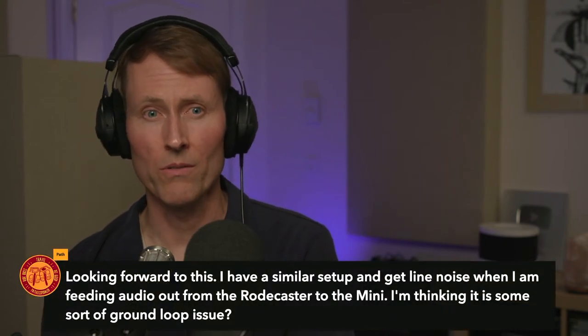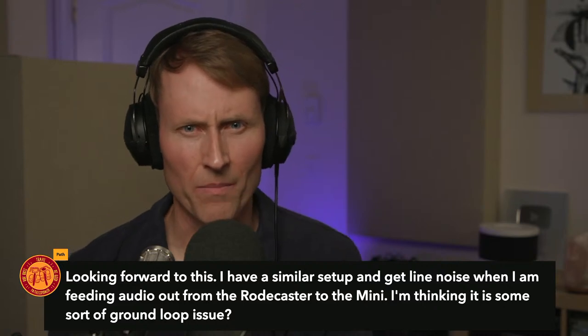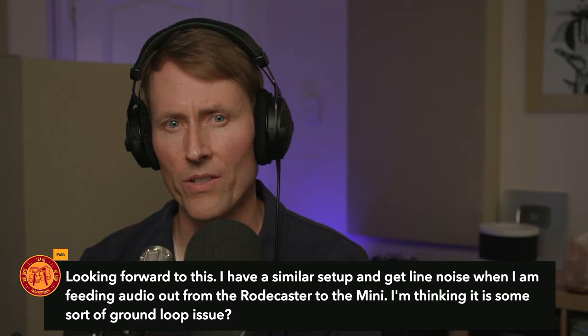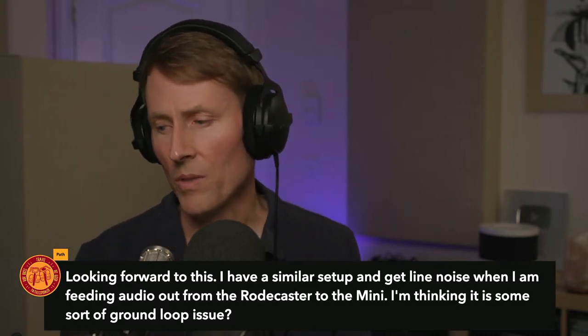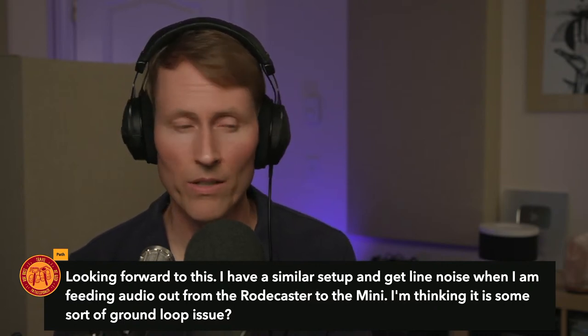Now, some other people I saw in the chat were talking about getting some ground, maybe a ground loop type of thing or a hum. And I think the thing you'll want to check is, number one, make sure that your cables are good. So test various cables. For example, we had a comment here: I have a similar setup, get line noise when I'm feeding audio out from the RODECaster Pro to the Mini. I'm thinking it's some sort of ground loop issue. That could possibly be. You can buy mic level or line level isolators.